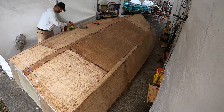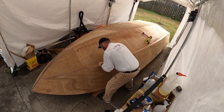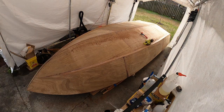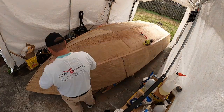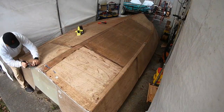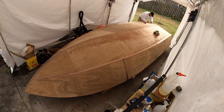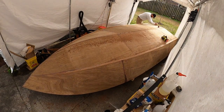We're running through this kind of on time lapse. We're doing a little work here where the sides of the hull were kind of overlapping the chines a little bit. To be able to make the glass roll up from the hull sides onto the chines, I'll explain that more when I go to glass it. But like everybody keeps saying, it's a whole lot easier to fair wood than it is to try and come back and fair fiberglass and epoxy.